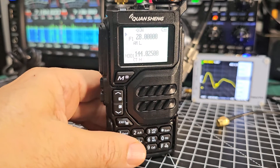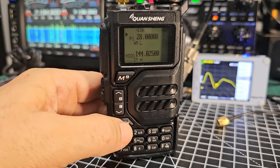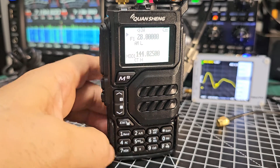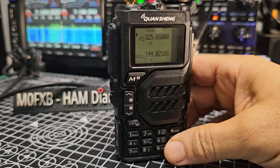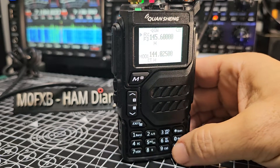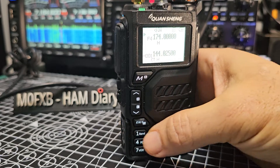In this video I'm going to show you what to do once you've got some of this super duper firmware. First thing you want to do is get it onto the band or frequency you want. You cycle through the bands by pressing F then 1 — on some firmwares keep pressing F1 and you're cycling through the bands.